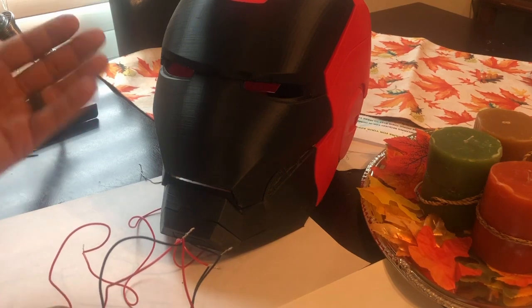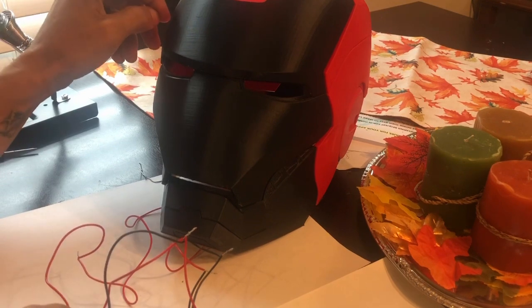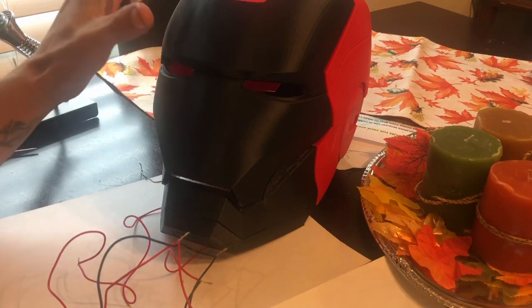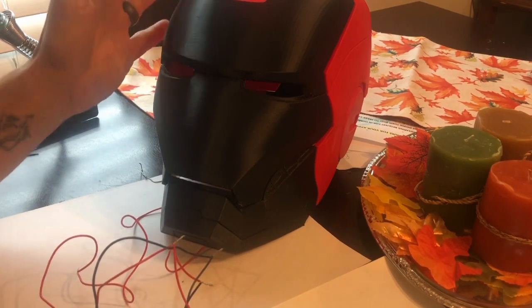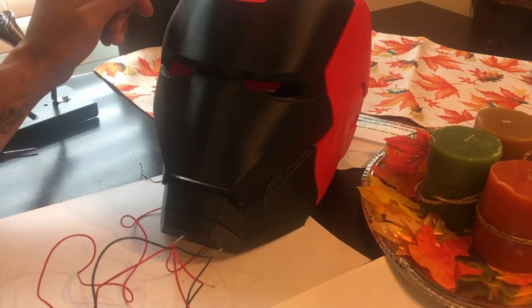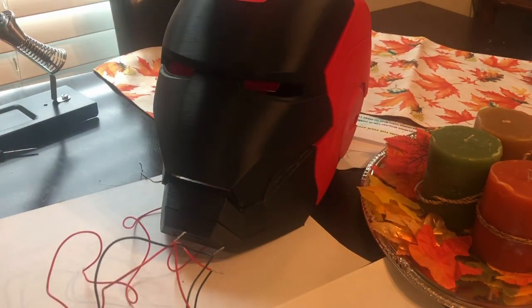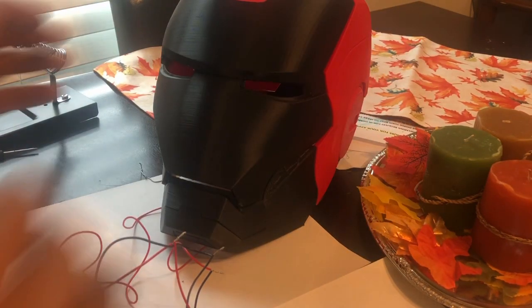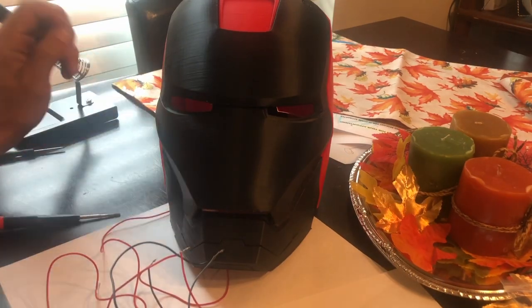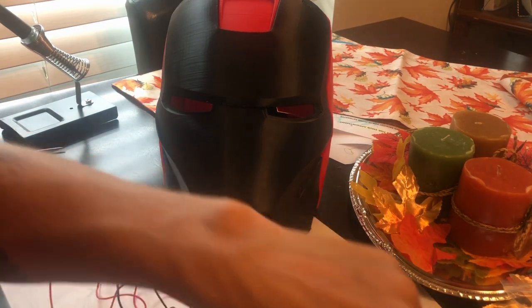What these need is that extra hinge — it's more of a stabilizer. You can see that it opens and closes but it goes really really fast, so you don't really want that. When you get the extra hinge, it'll actually help stabilize it a little bit more from opening and closing. It does go a little bit fast, but what's funny is if you drop this down to six volts, it actually struggles quite a bit to open. So once you add those extra hinges, that's really going to take a lot of weight and a lot of pressure off of opening and closing it.